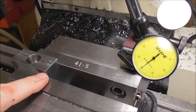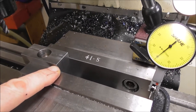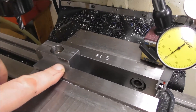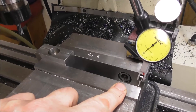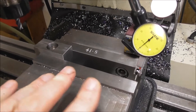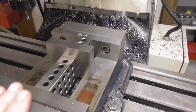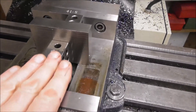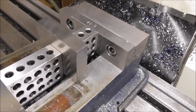You're getting a gap down this end and only getting grip on that corner - you're also probably crushing your part because of the very localized pressure. This is not a secure way to hold your part. You should have another part on this side, or if you only have one part, put in some sort of spacer so that the vice jaw goes in straight, or clamp your part in the middle of the vice so the forces are balanced. Use spacer blocks to give you clearance around your cutter.